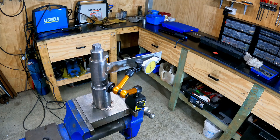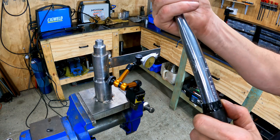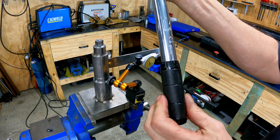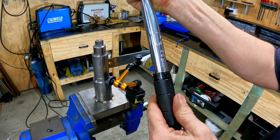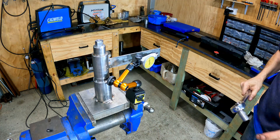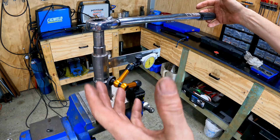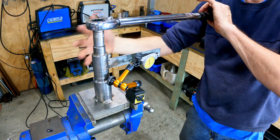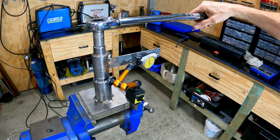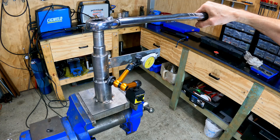All right, probably bad lighting, bad camera angles, bad everything. Let's do it. Torque - let's go from here, 40 Newton meters. There we go. Dial gauge is at zero. Let's do it... it's moving! So he's right - there has to be some flex in the bolt for the torque wrench to click. That's unbelievable.